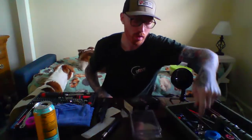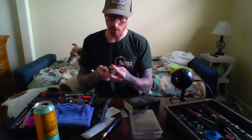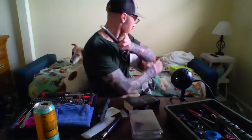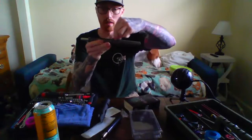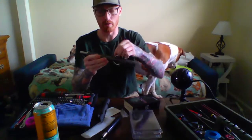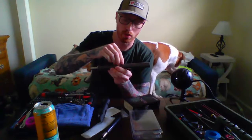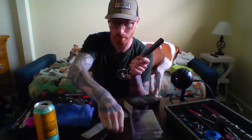If you don't have the right nozzle, you can just order it from Wolverine. Another thing I noticed: you want to make sure the fitting can slide through the slot all the way from the back to the front, because the front is usually where it sits. When I was putting this together it was actually tight and I couldn't rack it, so I had to file it a little bit — that was something new I learned.